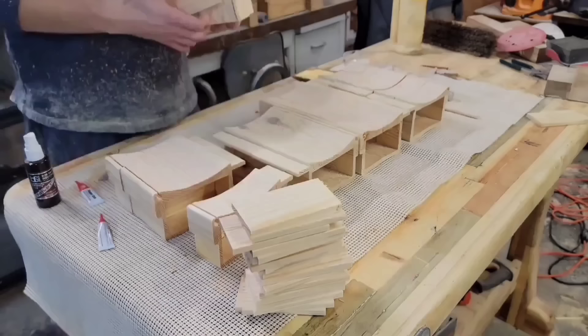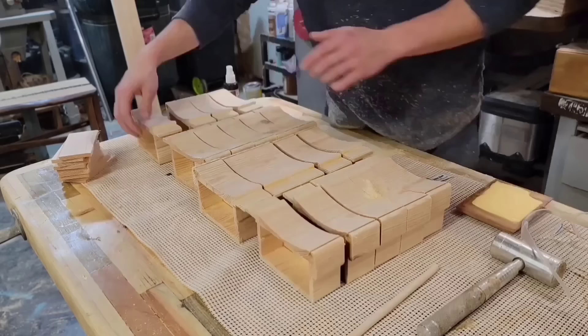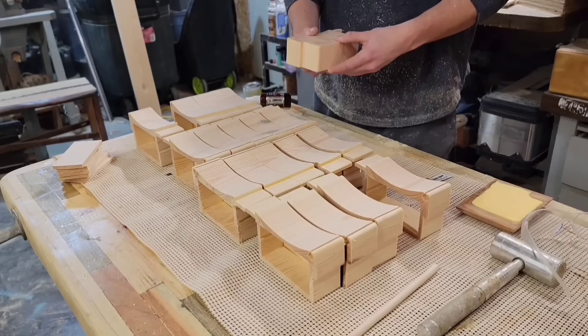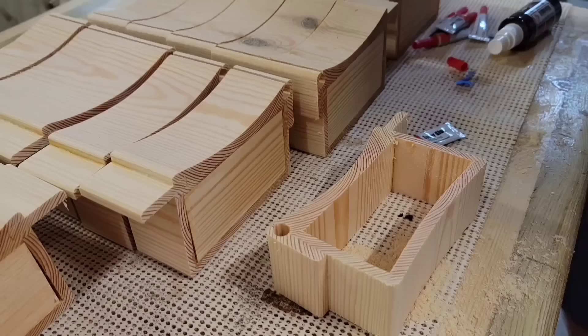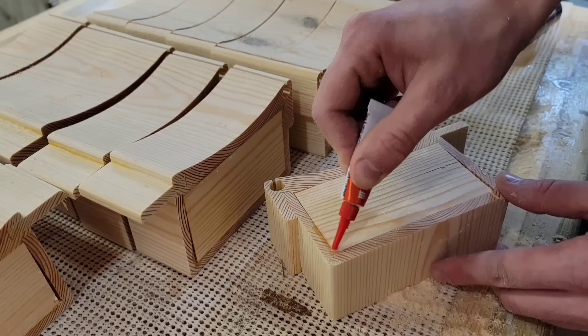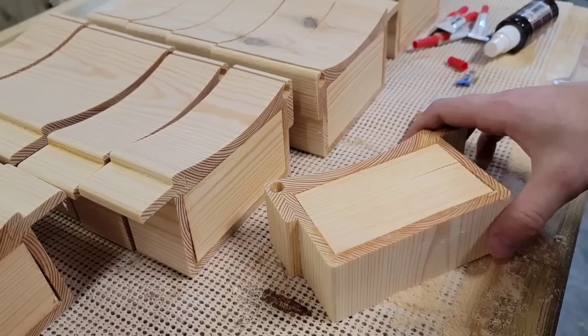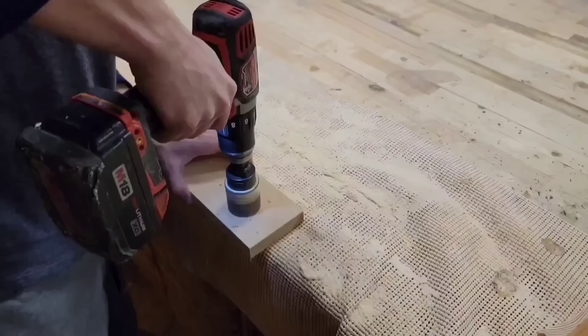Because the sides of the box are only a quarter inch thick, and because the grain direction runs up and down instead of the usual side-to-side for drawers, it really allowed the sides to warp easily — especially the back side — but once I added the bottoms, it squared everything up. In retrospect, I wish I had cut the bottoms a little bigger and cut a rabbet in the bottom of each box: the rabbet would have covered any small gaps and given me a ridge for wood glue. I used CA glue instead because there was no good way to apply wood glue without making a mess, but wood glue would have been better.